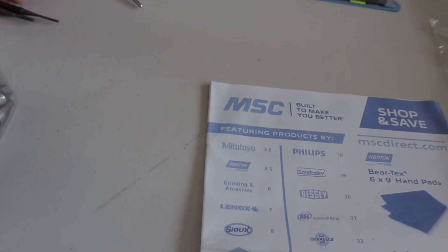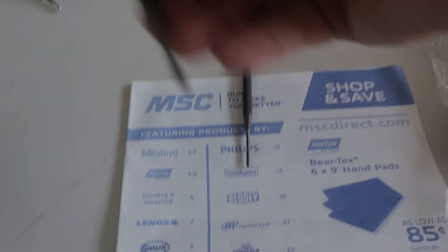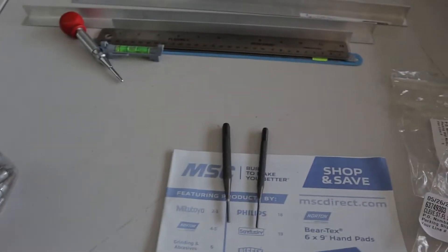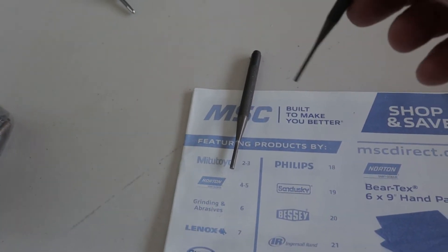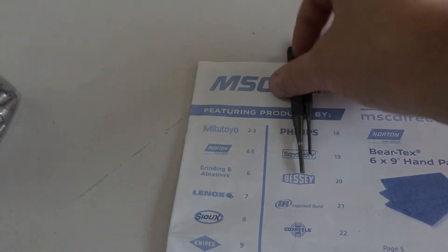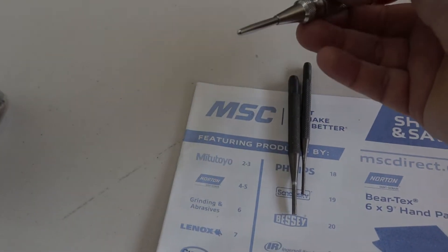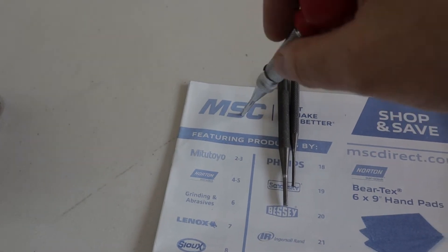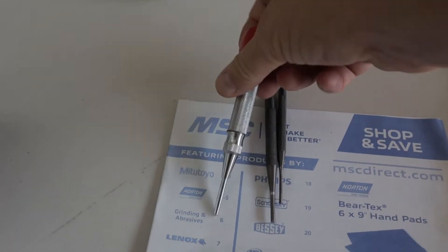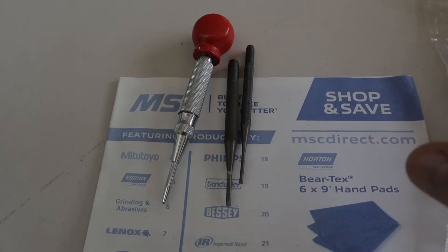As far as lining up your holes when drilling, I got a number 40 punch and a number 30 punch — basically from an old RV toolkit. If you have a friend with an RV build they have lots of these different tools. You can put this in the hole to get your rivets lined up. If the number 30 goes in, you know you can get the rivet in. You also have a spring-loaded punch — you can pop out rivets using this. You put it on the mandrel, put it on the rivet you need to drill out, pop it down, take your number 30 bit and drill down. It takes off the head. Aluminum rivets are very easy.